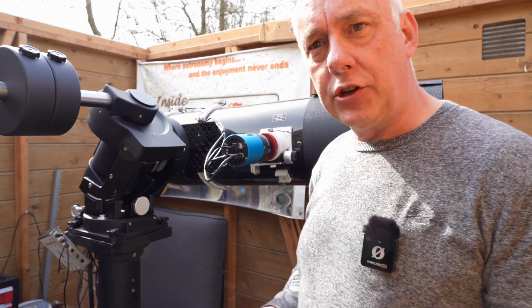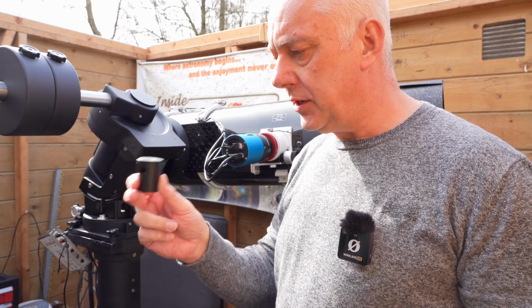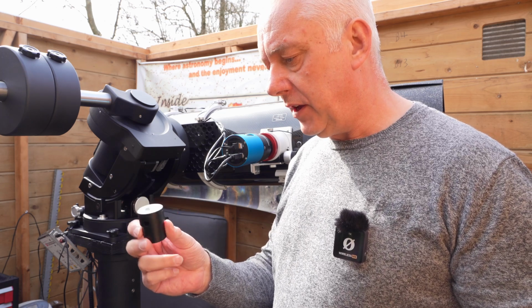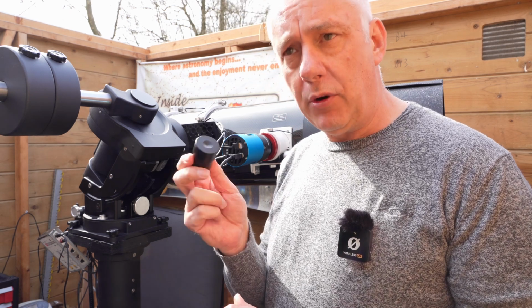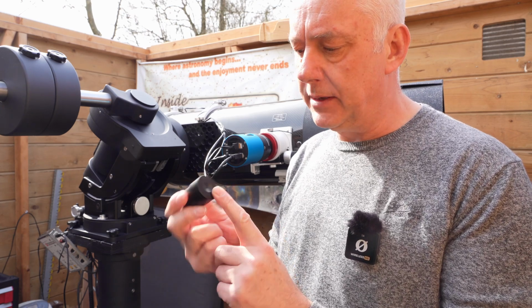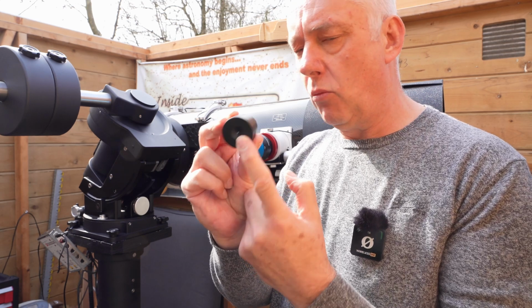Okay, to conclude this short video, I would recommend that you get yourselves a nice Cheshire eyepiece. This will serve you well for years and years to come. I did have a Sharp Star copy of the Epsilon, and it also came with a Cheshire eyepiece, but the hole in the center was too big. It was around about 3 millimeters. This one in the Takahashi eyepiece is somewhere around about 1.5 millimeters.